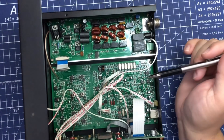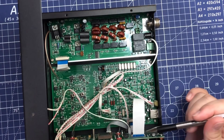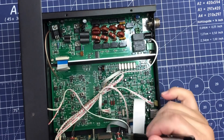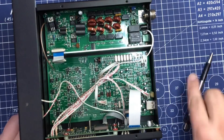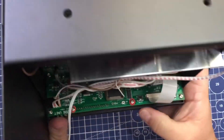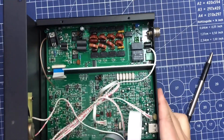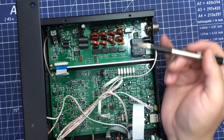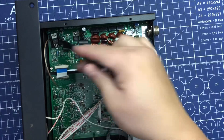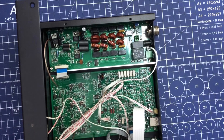These do have optional filters — this one does not. The optional filter would be located right here if it did, and there's a switch in here for setup and hardware. This switch is where we can do various things with setup, changing certain settings, and it's also used for the firmware upgrade. We have our main board, the PA unit on the back end, the final, and various other steps and ranges. That in a nutshell is the review of the TJ-5A — a nice sturdy little rig that doesn't break the bank.